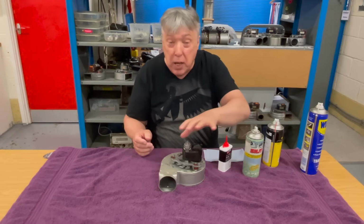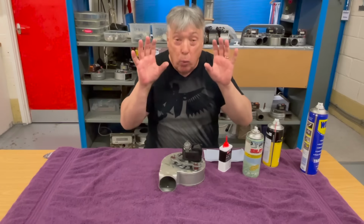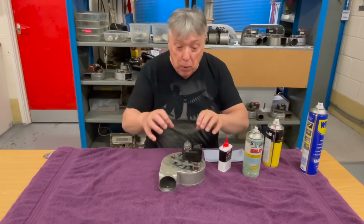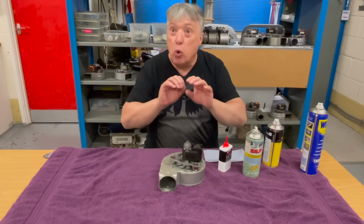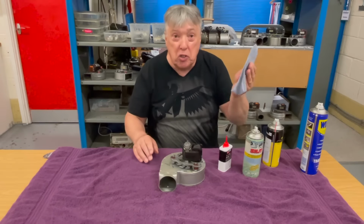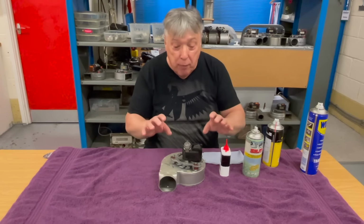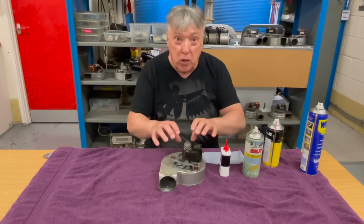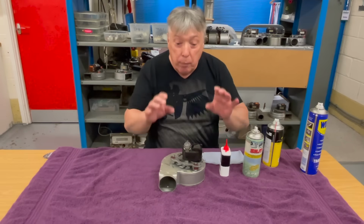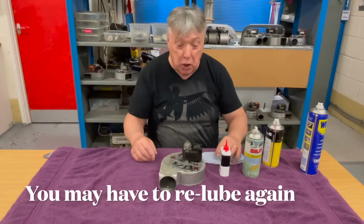But we need to protect this, so you'd either wear goggles, a mask, or put the cover on, just so this starts working, because we're going to have oil shoot all over the place. Well, in the flue, it's not too bad because we can just get more tissue paper and clean up the mess. So just be careful when we do switch it on for the first time without gas. We just want to lubricate it. Wear goggles, wear a mask, because it will splash.